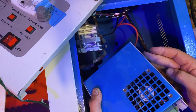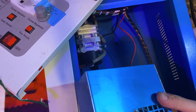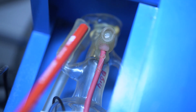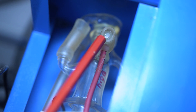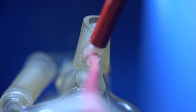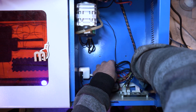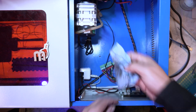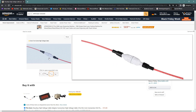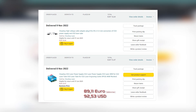The only thing that is not connected via Molex plug is the high voltage line, so I could disconnect the tube or cut the cable. I decided to go the easy way, as often people reported arcing and non-working laser tubes when trying to connect the positive lead to the tube. Notice how they used a piece of silicone tube and hot snot to insulate the connection. I think the problem was caused by the power supply and not the tube itself, so I ordered a pair of high voltage connectors. All in all, the fix will cost me less than a hundred bucks and should even improve the machine's performance.